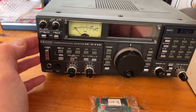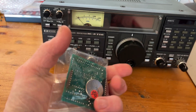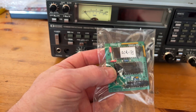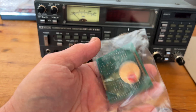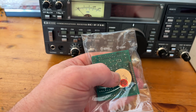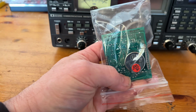There's a caveat here — they do suffer from a RAM board inside with a battery. What happens is that after the battery goes low, you lose the programming on the chip, so you have to have that constant supply. In order to change the battery, you need to make sure that there is power connected to the terminals, and then unsolder the battery. You have to make sure there's continuous power, otherwise you lose the RAM.